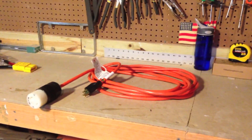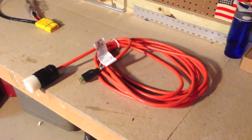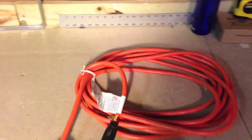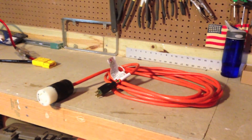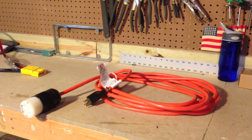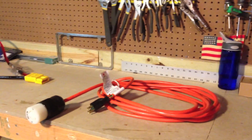My original setup: I went out to Costco and purchased a 7,000-watt generator and had my electrician install a 10-circuit transfer switch. That worked great. But what I noticed right away was that I only used about 500 watts of the 7,000-watt generator. I'm not hooking up the home AC unit or powering the whole house — I just wanted the essentials: the refrigerator, hot water, and convenience items like internet, power outlets to charge phones, and lights in the kitchen. After running everything through the built-in meters, I realized I hardly ever peaked above 800 watts.